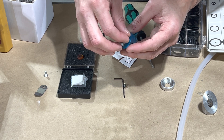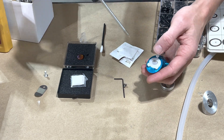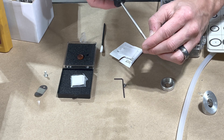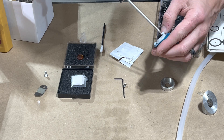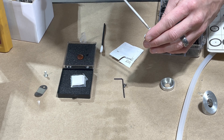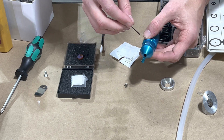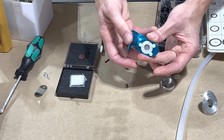All this is really doing is keeping the mirror from rattling around in the slot. Because everything's pointed down it won't necessarily rattle, but it does have the potential to move a little bit. Securing it down ensures your mirror always stays in one spot and keeps your laser spot focused where it needs to go. Now we're going to take out the two very small allen screws on the lower portion of the new laser head and set those aside, then the bottom half just slides off.